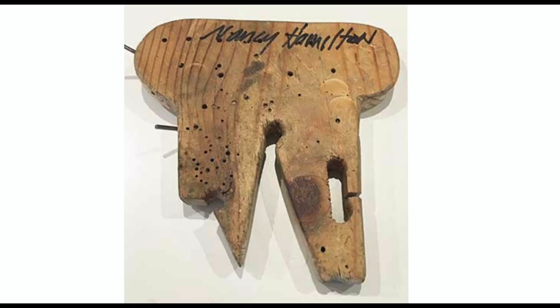I think people have to learn, and I want to do a video on this, about customizing a bench pin for what you're doing. I've got grooves to hold wire going across and little V's so I can saw tiny pieces out instead of just the big V. There are all kinds of adaptations. So that's definitely a bench pin, but an adapted bench pin. I've seen those too. There are quite a few, and they're expensive.